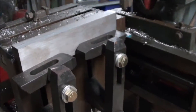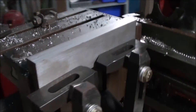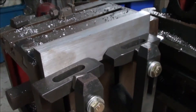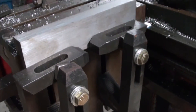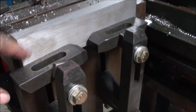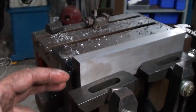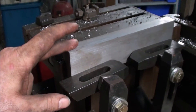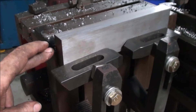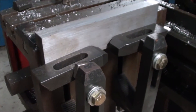Okay, last shot for this sequence. Just showing my setup here — I've got a clamp at the side of the table. That's faced off, still got to do the bottom side. The tricky bit is getting this distance from the top of the table the same when it's flipped — getting it at the same height end to end when it's flipped over 180 degrees is going to be the challenge. We'll see how we go.